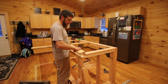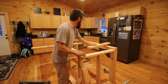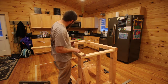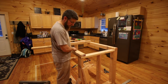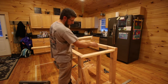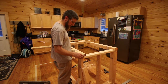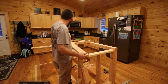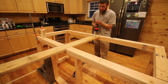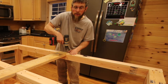I just finished tightening these last top pieces. I'm going to glue them in and then screw them down. The top plate going this way I have running over the end wall top plate, so that will help tie it all together and make it more rugged. We shouldn't have an issue but it will definitely help out. Now this being oak, we definitely need to make sure we pre-drill it. I'm just going to use an eighth-inch drill bit and pre-drill the holes.